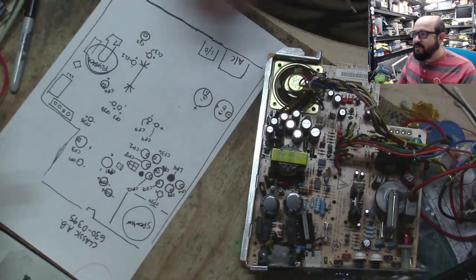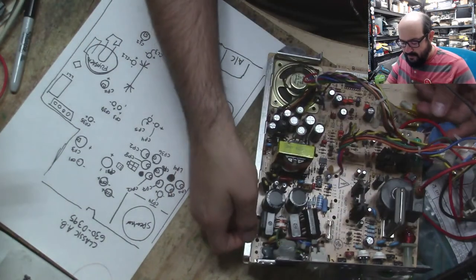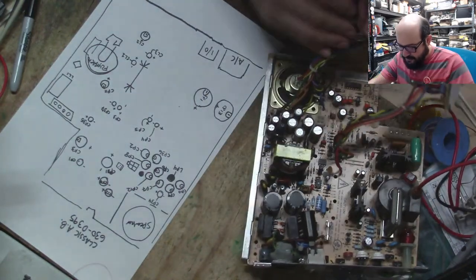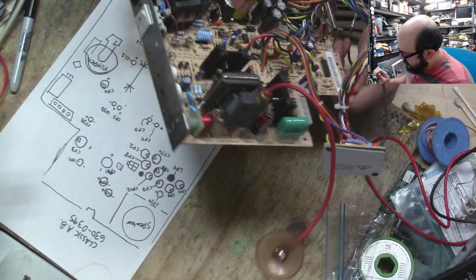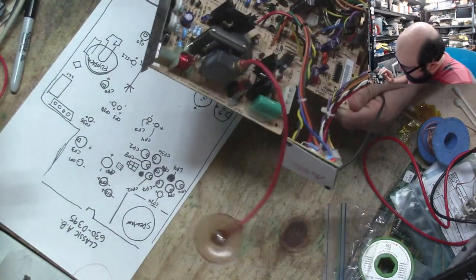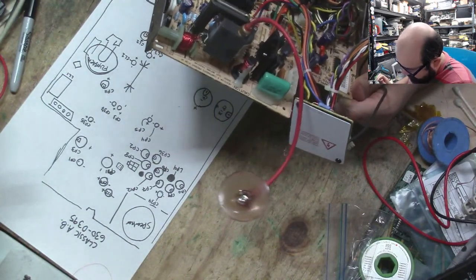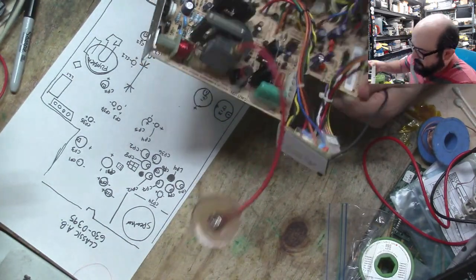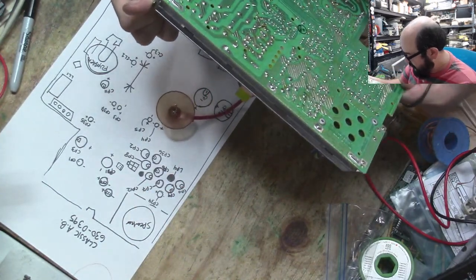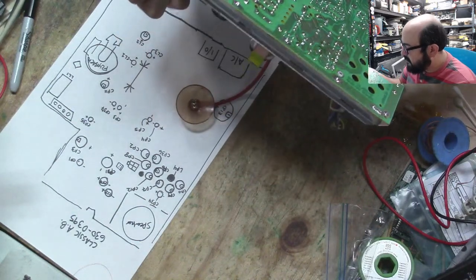Cool. So now we can start ripping the caps off of this thing and we know where they go, at least. Well, at least that's the plan. We'll see how much of a fool we make out of ourselves later. But generally speaking, looking at this board, it doesn't look like the capacitors have leaked, which is a little concerning because, well, no, I take that back. That looks like some leakage. That doesn't look like some flux, but I could be wrong. Because if there's that weird hourglass shape going on, then that's kind of frustrating. This all looks like flux, but what the flux do I know?